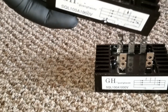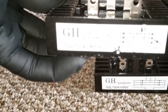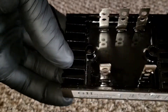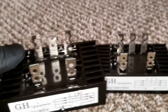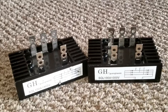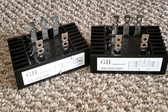On other models, they take the entire rectifier, drop it into a case, fill it with glue, and embed the heat sink with the diodes inside. This heat sink helps dissipate the heat fast so the unit doesn't get too hot. I bought two of these bridge rectifiers — one as a spare in case one burns out, and we may need a second one for a second wind turbine.